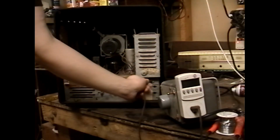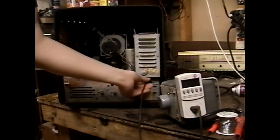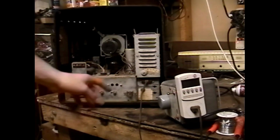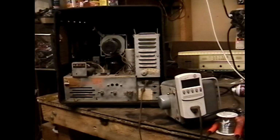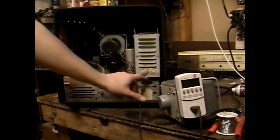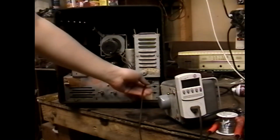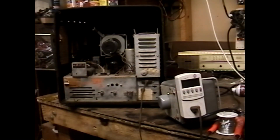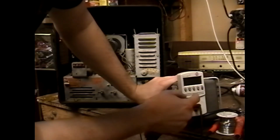In fact, I can feel the power cord is warm in this segment where it meets up with its interlock end, which is where a lot of flexion occurs and where a lot of resistance tends to build up in these cords when they get older. So that would be where it would warm up if there was a lot of current coming from this set. Let me see if I can capture the wattage and or amperage this is drawing.